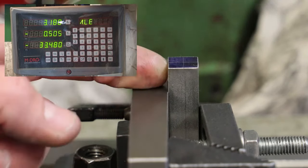Incidentally, or interestingly, when I used the ball locator, I used two methods. One was to find this left face, then center the spindle quill directly above the left-hand edge, and then move across by 6.35 millimeters. That method, of course, will only work to get it exactly in the center if the stock was 12.7 millimeters. So there's likely to be a very slight error, 0.02025 of a millimeter left to right. The other method we used, of finding the rear face and then finding the front face and dividing it by two, would of course compensate for any errors in the thickness of the material. So front to back, we are going to be absolutely spot on. Left to right, very slightly out.